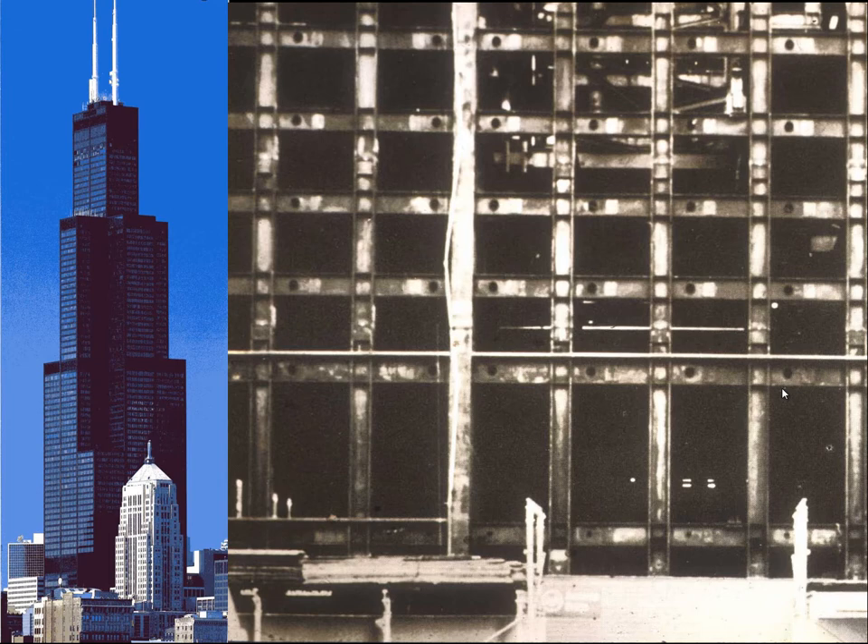The same concept was applied to the Sears Tower. The Sears Tower had much more generous windows, but as a consequence the rigid frame was not quite as rigid. To compensate, they ran rigid frames through the building, creating basically a three-by-three layout of nine tubes. The walls of these tubes were constituted by this kind of rigid frame with moment connections. The field connections were made at certain points and all these joints were welded in the shop. The fundamental unit was basically a vertical with two horizontal crosses on it, and the bolted connections in the field were made there.